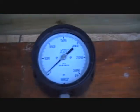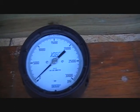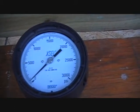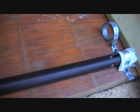On the high pressure side, the gauge goes to 30,000 psi — that's 30,000 psi in 5,000 psi increments — and it's going right into the tube. The tube is filled with hydraulic oil and all the air is out of it.